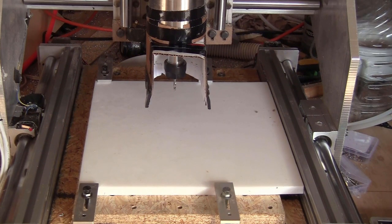It is a kind of plastic that has very good dielectrical properties. And that's the reason that my friends want to use it. But it also has high tensile strength, so it wouldn't be very sticky to cut. With my high-speed spindle, the material and the bit might heat up very quickly. I'm afraid that Teflon will stick to the bit and ruin everything.